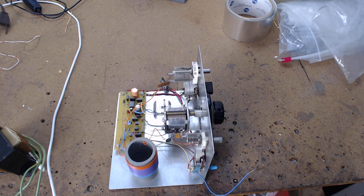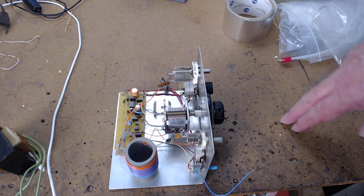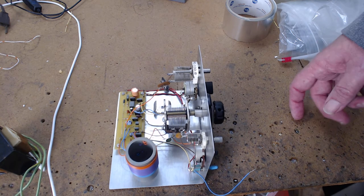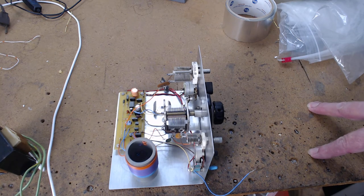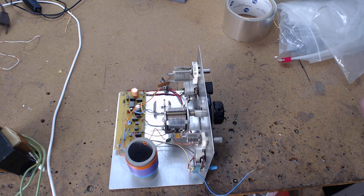And some of the really good circuits in Radio-Electronics, they tell you if the circuit doesn't oscillate, reverse the wires on your tickler. And I'm going to tell you to mark the wire before you reverse it, because if it jumps out of your hand or whatever, guess what? You'll put it back the wrong way again. And I had somebody do that to me. I told them to reverse the tickler winding, and they put it back the same way a second time.